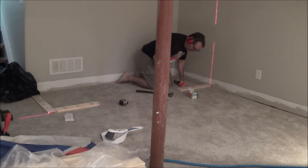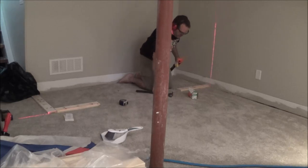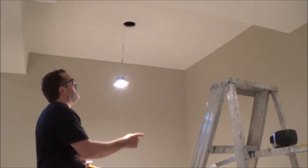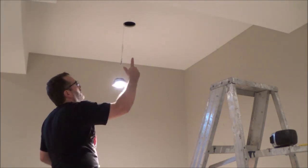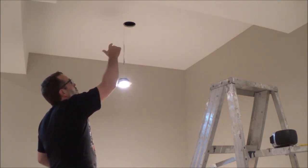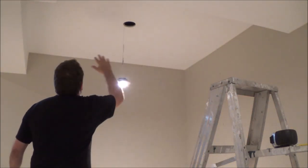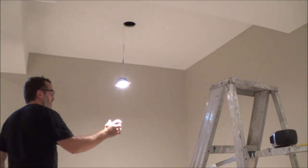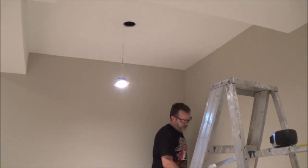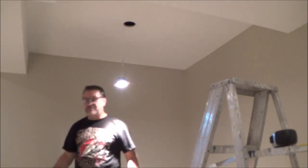All done. Now we can start putting up the header - I'm just going to use one header since it's not load bearing. I went and marked the floor joists above by dropping a light and sticking my iPhone in there. I marked off where all the joists are so this entire header now has good solid nailers. I kind of lucked out - there happens to be a stud right along where the vertical piece is going to go. Now it's just a question of cutting the top plates, screwing them in, and connecting top to bottom - framing is done.